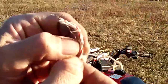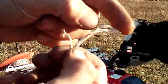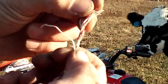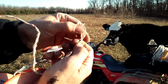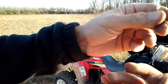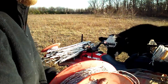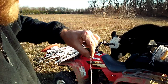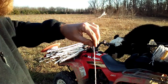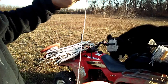This is our polywire. You can see it's all frayed right here at the end — here's actually one of the stainless steel wires braided in. I'm not sure exactly how many but I can count at least six and there could be more. This is very lightweight. When I switched to polywire that year when it was snowing, since it's not very wide there's not much surface area for the snow to stick to. I didn't have the problems with sagging from the weight of the snow, so I've been using this ever since.